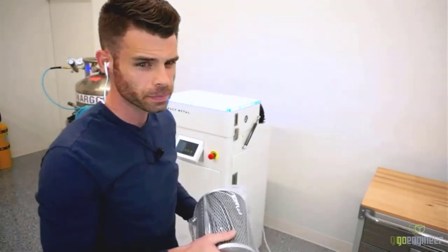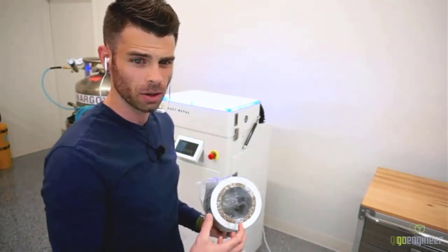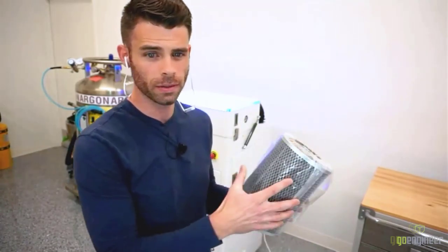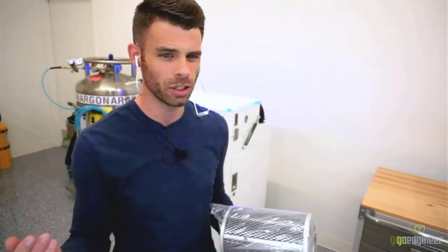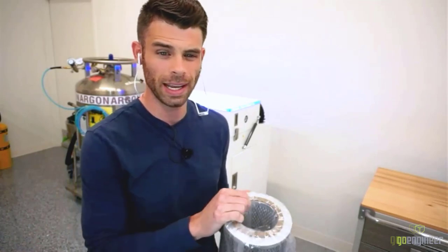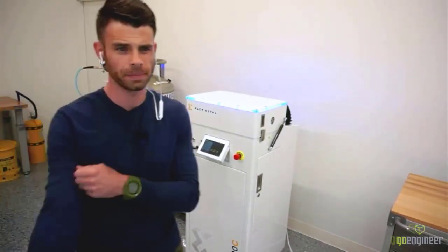When we change the filter, we take that entire metal container out and have a bucket of water handy. We open it up, immediately pop the filter in the bucket of water, and take it outside. The idea is that when we remove it from the filter housing and expose it to air, you might find a little bit of smoldering, so we just want to cool it down and inert that filter. That filter is one of the consumables we use.